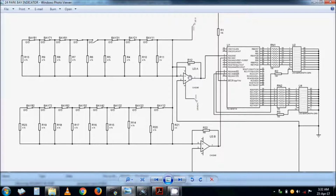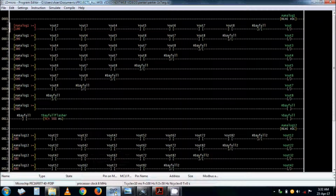So a voltage here that corresponds to position 1 would need 2k here with that feedback resistor. First I tried the other R-2R ladder, but it wouldn't work. Just use equal step resistors. So what is critical is that feedback resistor, which you have to adjust so that you have that voltage. But this was working, as you see with the simulation.